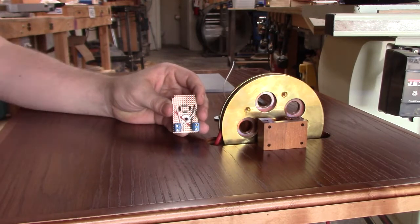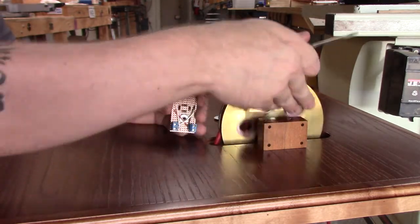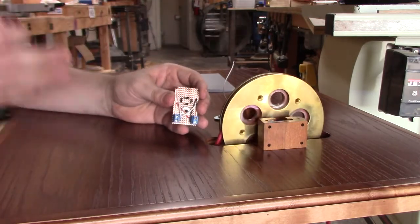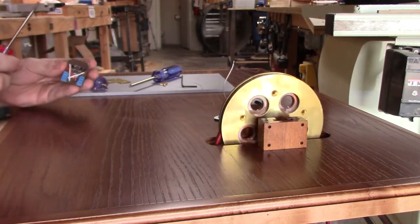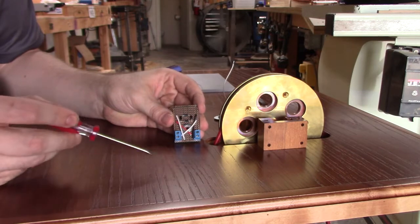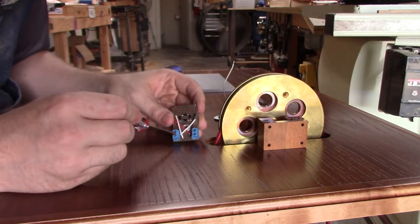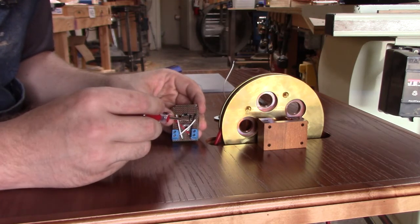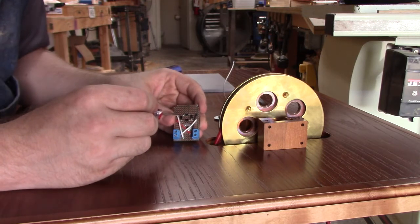And as it is, with the wheel spinning one way or spinning the other, going through the motor, that would cause either positive voltage or negative voltage, depending on which way you had the wires go, and we want it to be universal. So we've got four little diodes here, and the signal coming from the motor will be coming from these white guys here and here, going to this little corner of the diode matrix, and then this corner of the diode matrix.